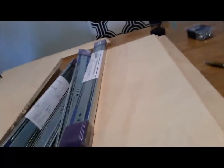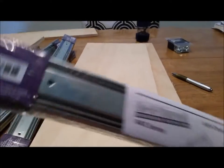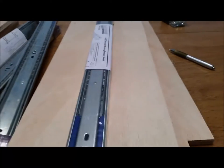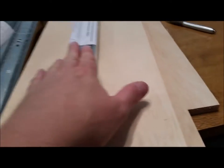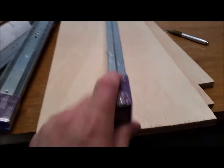I got three-quarter sanded pine for the back and the sides, two feet wide, and some more drawer material. I'm going to try to do one side at a time — four drawers and a middle piece. I went with 22-inch drawer slides, ball bearing, side-mounted. They take a little more measuring, but they're rated to hold 100 pounds and have a soft-close feature — kind of a nice snap when you push them in.